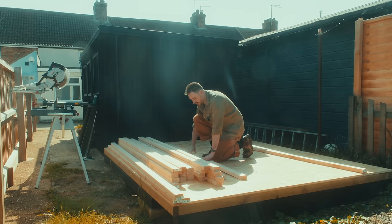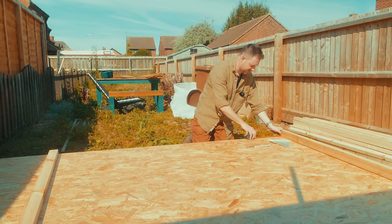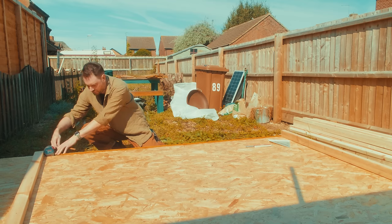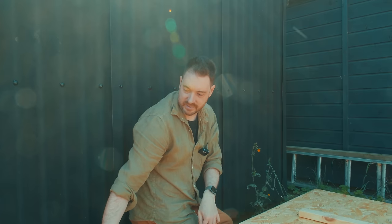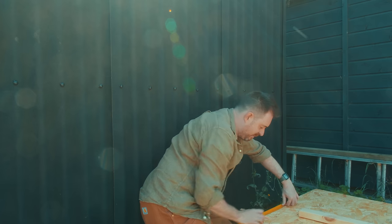I've got some three-by-twos to make it out of and I'm going to kind of over-engineer it, which will give me more options in the future. The base is obviously the size of the workshop, so I'm going to use it as a template and mark out how tall I want the front wall to be. On the back of the base I'm going to mark out the height of the rear wall, which will be slightly shorter so that the roof will have a pitch to it.